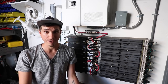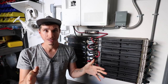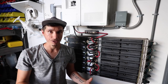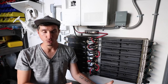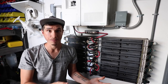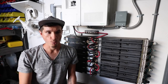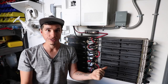The first difference is longevity. Lithium-ion batteries can cycle two to four times more than lead-acid batteries. If a lead-acid battery setup can cycle 1,000 times before needing replacement, an equivalent lithium-ion setup could cycle 2,000 to 3,000 times. While a lithium-ion setup costs more initially, over the long term the batteries are going to be much more economical.